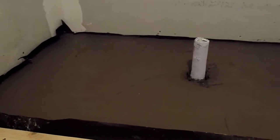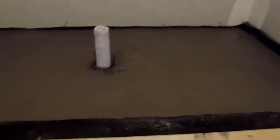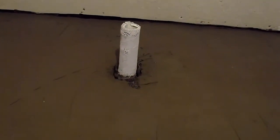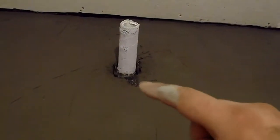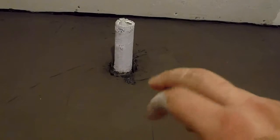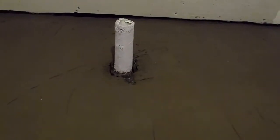I can always just mix up a small amount of concrete — got a whole other bag — if I need to fix any bits of the corner or whatever. Hopefully I didn't cover up too much of the drain here. I had that paint roller just kind of sticking in the hole so nothing got in the hole. And then I X-ed out the paper so the flaps kind of went out a little bit and tapped around the edges just to smooth it around.